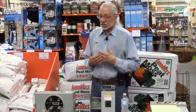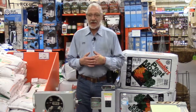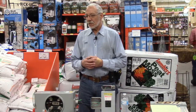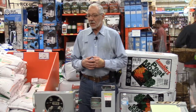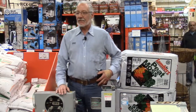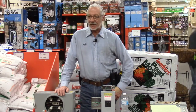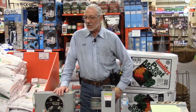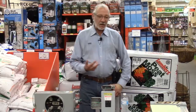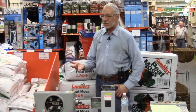A modern house is going to take a lot more circuits than what was done even 30 years ago or more. A modern kitchen, at a minimum, should have at least 3 circuits run into it now. You have microwaves and things like that that sit on the counter or wherever. The refrigerator should be on its own circuit. Countertops should be on their own circuit. If you have a dishwasher, that's its own circuit.